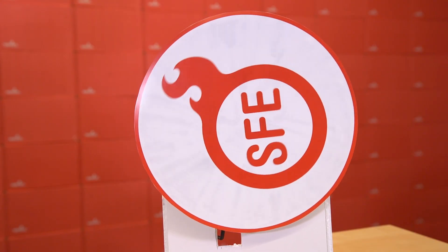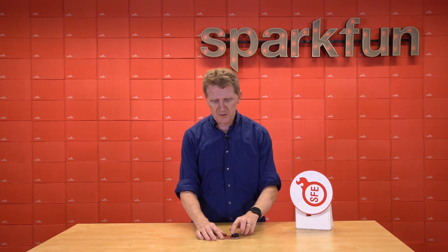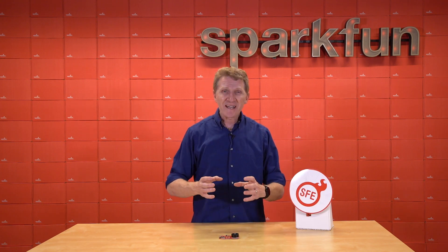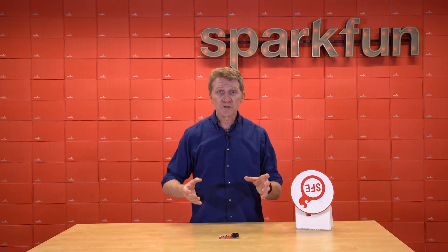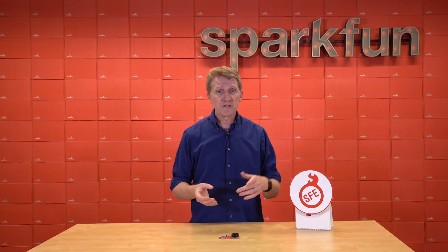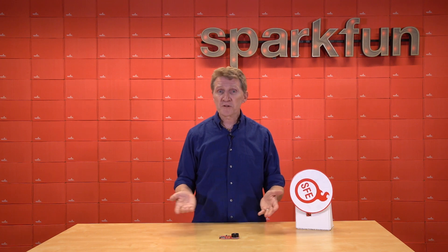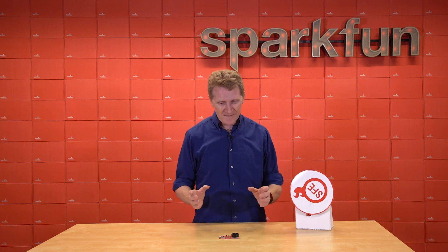Now, I do want to stress that this really is a board designed for prototyping. If you're making a smart knob with it, this motor is perfect — it's really smooth, perfect size, and it's going to give you great feedback. However, if you want to use this to drive something, this motor is not really a high-torque motor, so you're not going to be able to open and close your blinds with it, or pan your telescope across the night sky, or even run your funicular up and down in your Italian Alp model train set. You'll need to go with a bigger motor for those applications, but you'll already have everything programmed and prototyped and ready to go, thanks to the new SparkFun IoT Brushless Motor Driver.